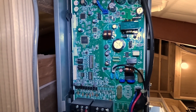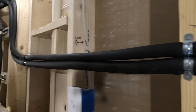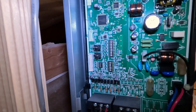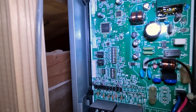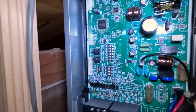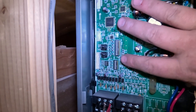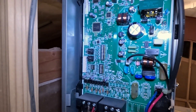Those are DIP switches. Depending on your zones — we actually added a third zone to this as well, which we're in the process of finishing up. There's a switch bank in here for addressing. The switches correspond to each zone: this is a three-port branch box, so only one, two, and three will do anything. One is A, two is B, three is C — that's explained in the manual. We have one and two on right now, and we're going to turn on number three. Jared's going to flip it right now.